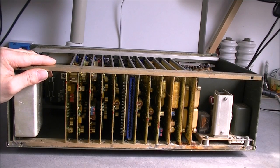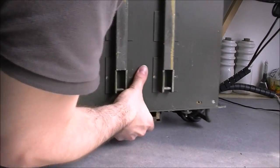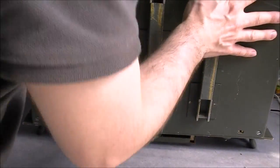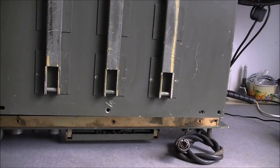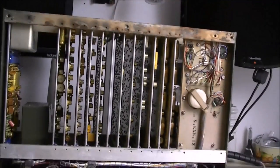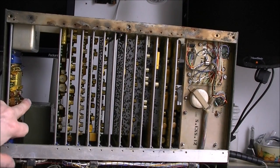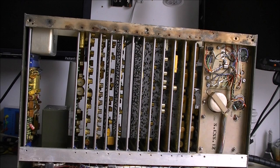First I will undo the bottom cover - six screws - and the back cover goes like this, giving us a better view of the contents. We can see the bottom side of the power supply, shielded boxes, and all the PCBs. It looks like the front panel will be possible to flip out all the way because all the wires are on this side, so I will be able to rotate the front panel and see what we have behind.